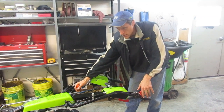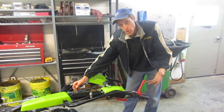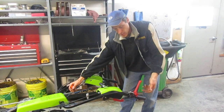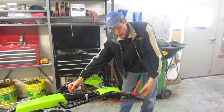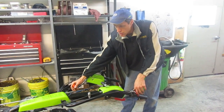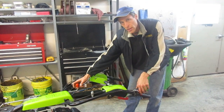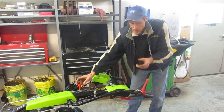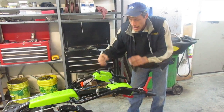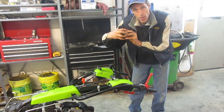Just push the clutch down ever so slightly. The G110 has the active clutch control — this is the only tractor model we sell with this style of clutch, so the clutch control is on top. Some of the newer ones have a little safety catch right here; this one doesn't have that because it's a little older. At any rate, just keep a little pressure on the gear shift in the direction you want it to move and bump the clutch a little bit. Every time you bump the clutch, that PTO shaft is going to turn a little bit, and as soon as those teeth line up, since you have pressure on them, they're going to drop right into place.